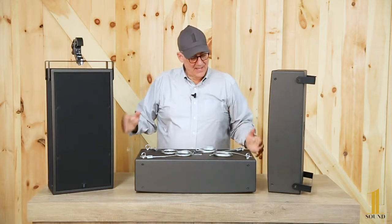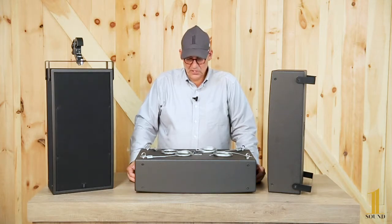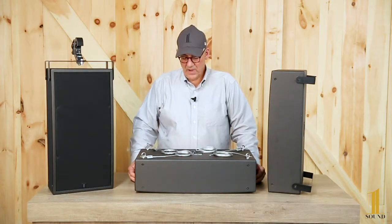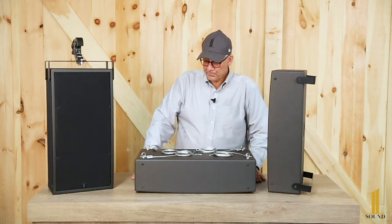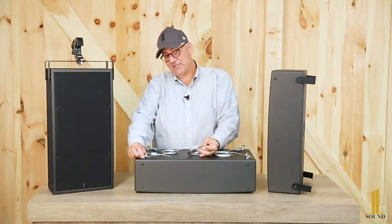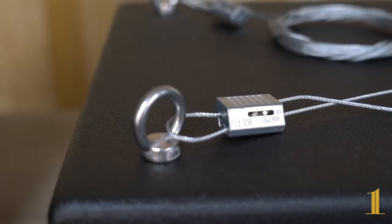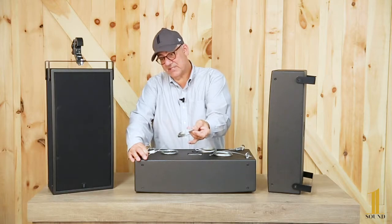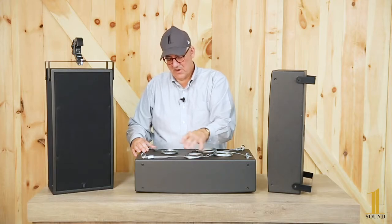The W-sub is also being used recessed into a ceiling tile, and we have a kit that helps the installer do that. It comes with four M6 stainless steel forged eye bolts, and also a Rise KL 75, 50–75 pound clip with galvanized aircraft cable.